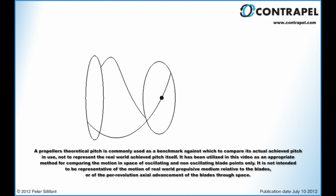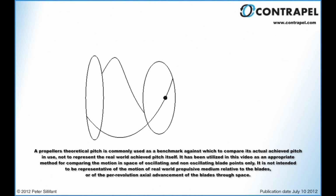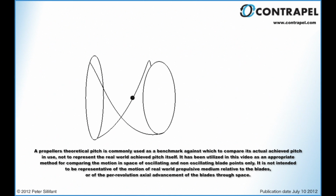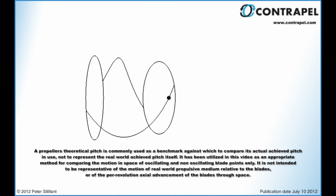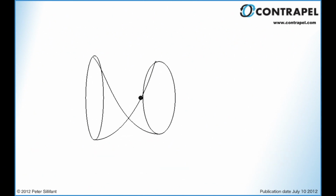When turning, the radial component of the blade pitch just downstream of the dot is continuously moving out from the page and down, so that when moving along the rotating blade, only the axial component of the movement is visible in the motion of the dot.